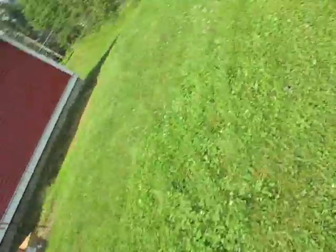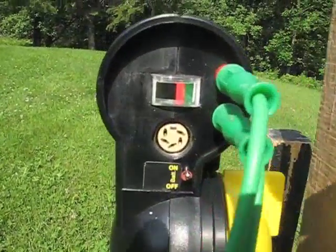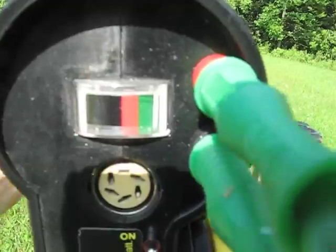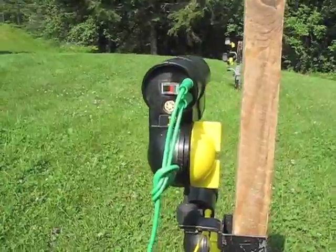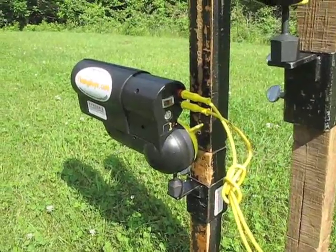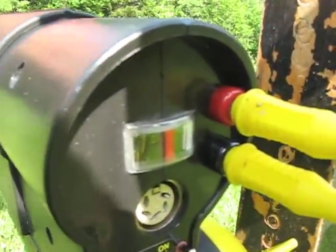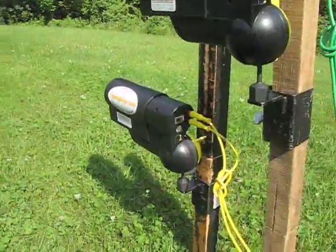And then if you look close up, I've got my meter in the green, and if I put something in front of it, the meter drops into the black. So if somebody goes through there, boom, it's going to send a signal down that green wire into my timing system, and that's going to be one set of eyes. And then down here, I have an identical set going into my yellow pair of wires, and that's also going to have a meter that goes like that. All right, so there's our basic setup.